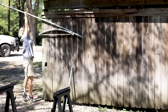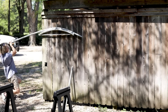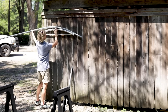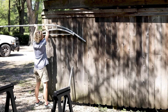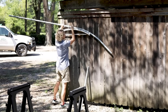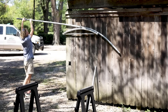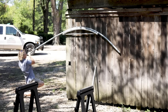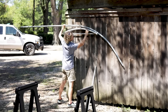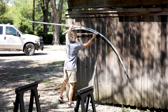Make sure the pipe is running on the ridges of the bender. Reach up high and start pulling it down — this is a good reason to hang the bender up high so that you have plenty of leverage. Come back and look for your next 18 inch mark, then slide it down to that mark. Make sure not to twist it; keep it in the ridge. Reach up and bend it down. Continue sliding to each mark — notice the arc beginning to form on the top rail.